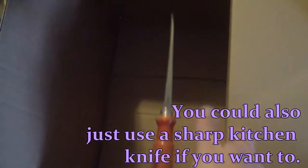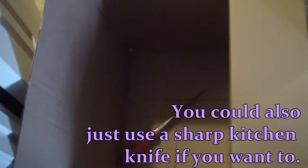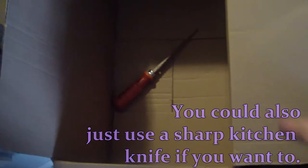What I'm using to cut the holes is a jab saw — I'm old school and I already had this, so I don't need to buy a hole saw for just two holes. I put a box below to catch anything, stick my arm in just like this, and do the jabbing. All the drywall dust falls into the box and I use a shop vac the whole time to suck it up. Make sure you wear a respirator so you don't breathe this stuff in.